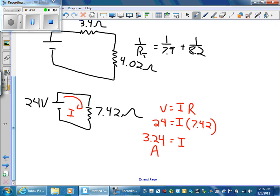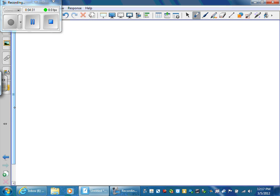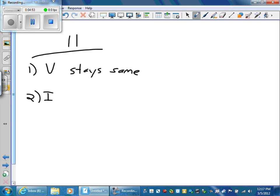I asked for the voltage drop and the current through all of those original resistors. So what we're going to do is work backwards, using our rules that you wrote down, and I emphasize that you had to write down. Let's go to a different sheet. Parallel, the mathematical symbol, two parallel lines. What are the 2 things? What stays the same? Voltage stays the same. Current does what? Divides. Current is going to split up. In parallel, voltage remains the same, current splits up.